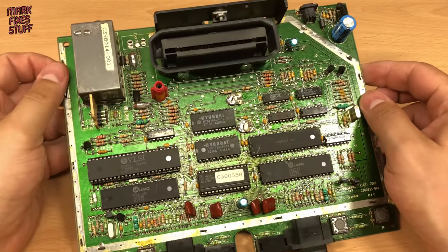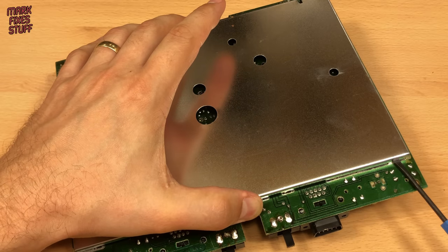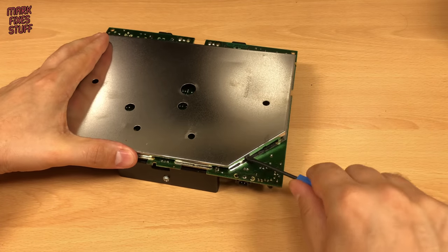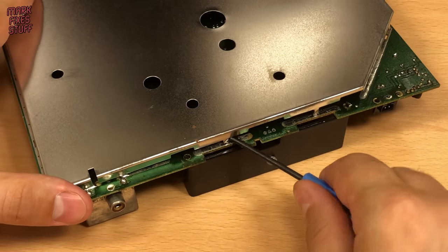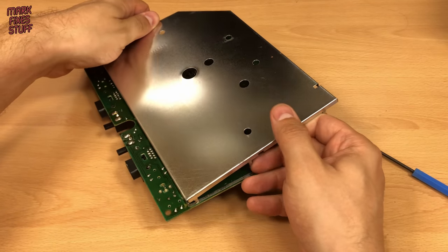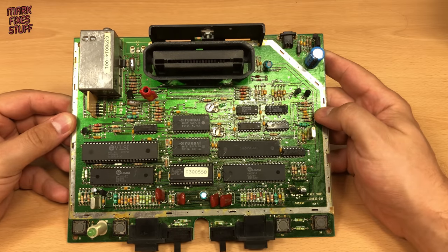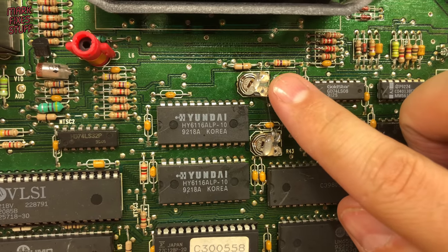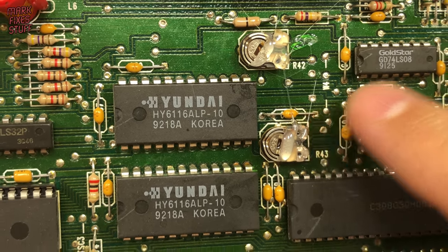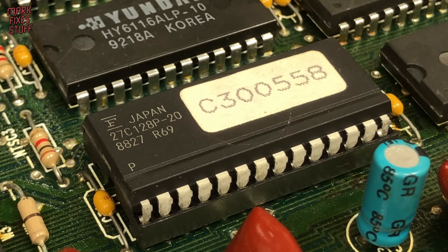Before we can start work we need to remove the extra shielding on the bottom of the board as well. I gently lever these off with a blunt tool, being careful not to damage the board at all. I actually love the layout of this board — I think it's really functional. These 500k parts adjust the colour phase of the 7800 and 2600 portions of the console respectively. And just look at this awesome vintage Fairchild EEPROM with a decorative moulded ridge running the full length of the chip.